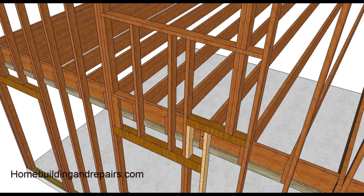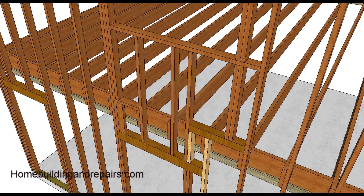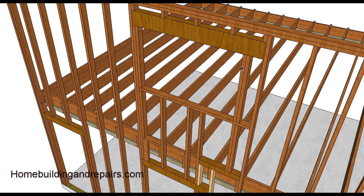Something like this usually works pretty well. You can simply drop a 2x4 down here — I've done this before where I don't really nail it, I just drop it down and put a couple of nails at the top, then put my trimmer. The weight kind of holds it together. You can see here where the weight is transferring — whatever is on top of this header transfers down to here, where you might want a little more support.